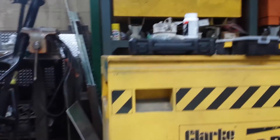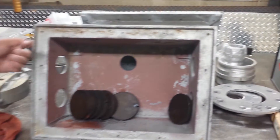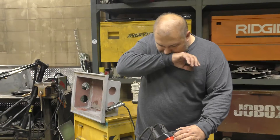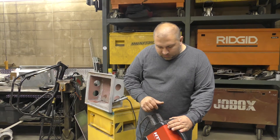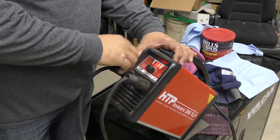So did you call me to do some work? I guess I'm getting put to work. You gotta finish welding these plugs on this thing here — weld those plugs on those cast iron pockets. Then you have a program for cellulose electrodes, 6010s, and other hard-to-weld rods that need higher voltages.